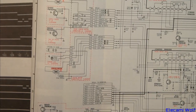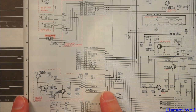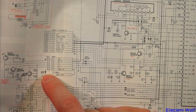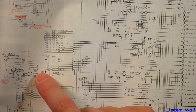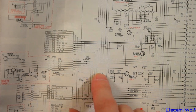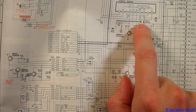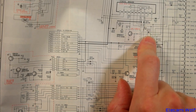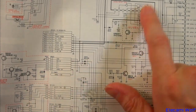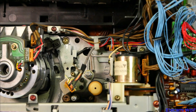There are three of these PF things that seem to be related to clamps or those diodes. It looks like a voltage rail clamp kind of thing. When this point rises, the unregulated 18 will start flowing into that point — I guess it means this motor driver can be powered from multiple sources, diode-blocked from each other. So maybe this unregulated 14 is only available when the rest of the machine is off, and then when it gets turned on the 18 volts higher voltage powers it. It's a bit weird. Perhaps we should test those diodes — if the 18 volts was back-feeding into the 14 volts that might be a reason for the fuse to blow.